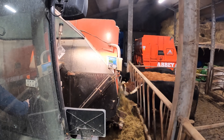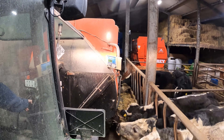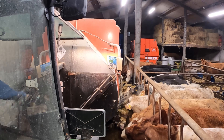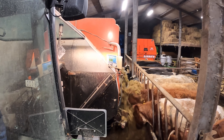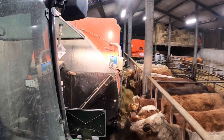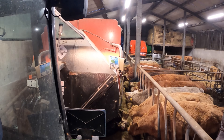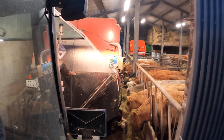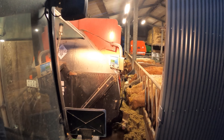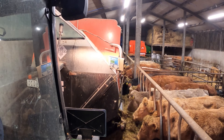It'll mix up a couple of ton, two and a half ton of pit silage, no problem at all. We've done a bit of work on the door - that's why we stopped using it. The door had gone a little bit weak because it hadn't been relined. We had it relined shortly before we stopped using it but didn't line the door, and a bit of a twist came on it. We took the door off, got a whole new piece made up, stronger than originally. We've also put a few new tips on some of the blades - there's a set of eight knives that'll chop up the silage nicely. There's a weight cell on it where it weighs the silage as it's going in - that's all in working order, lights are working, everything works. If you're looking for a reasonably priced diet feeder, give me a shout, send me a message on Facebook or Instagram.